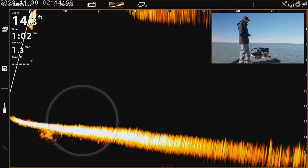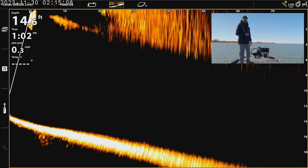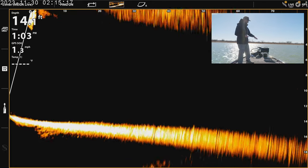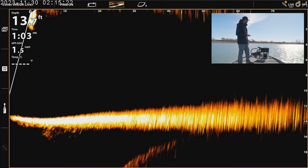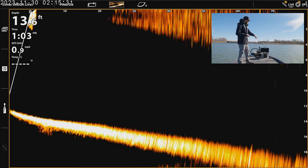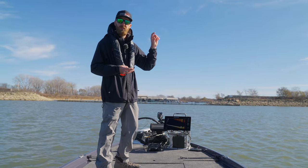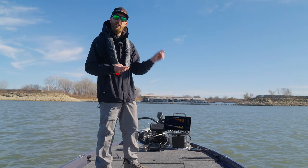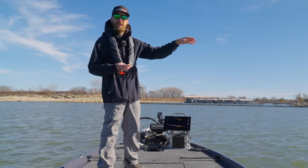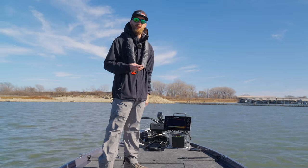You can see some little bait fish on the bottom there. Let's make one more pass around at this brush pile and see if we can get a different look at it from another angle. This is a good opportunity to talk about what you see at the top of the screen there. I have removed the Mega Live mask from this transducer, and you're picking up some of the rays off of the sun penetrating into the top of that water column. If you're having that issue — also if you're seeing some double images, if you're seeing your lure twice or a fish twice — that's from the reflection of the sun. You can put a Mega Live mask on and it will eliminate some of that reflection as well as eliminate those double images. I've done a video on that. It's a pretty easy deal — just a little adhesive piece of foam that will stick right on your transducer.